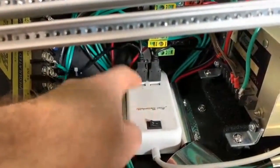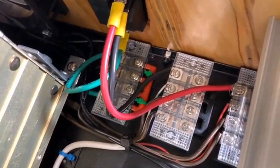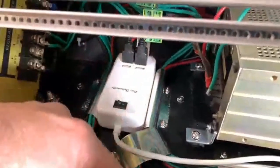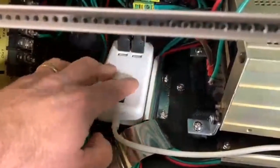Are they actually on separate outlets on the wall, or how is that all wired up? Because I went ahead and coordinated everything, I put a separate USB power supply inside the case. And here's the USB plugs going to the fans and to the lights. And then that's connected to the mains down here. So I only have one connection and one switch to put the whole system on. And I was afraid of noise from this power supply. So I went to a place that sold hobby metals and got some tin and rolled my own tin shrouds to run my DC power from my bus boards through, and grounded those to the case just to try to cut down any noise coming from this power supply being induced into those wires running to these bus boards.